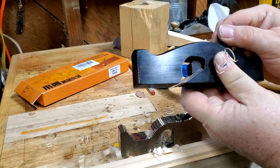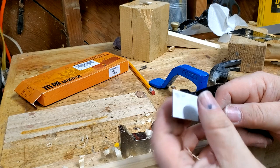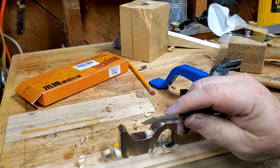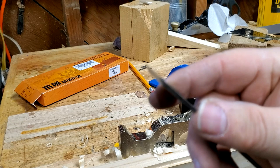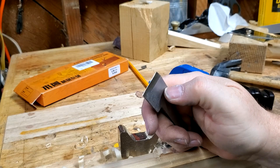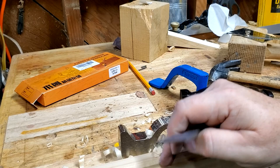Let's take it apart and take a look at it. There's the wedge — it's just a hunk of wood, probably left over from all the other material. And here's the blade. I didn't check to see how flat it is; it's got kind of a rough finish, certainly not polished like a lot of people like. If we look at the edge, it's got a little tiny bit of concaveness to it — this was just done on a grinding wheel. It looks very even and pretty square. It looks pretty nice, but it needs a sharpening.